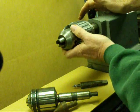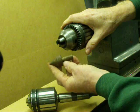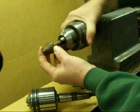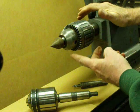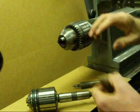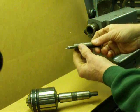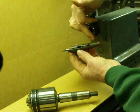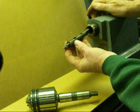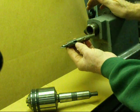One other thing you can do — and this may not be best practice either — is hold a 60-degree center with a straight shank in a chuck, sometimes just to get you by quickly instead of using a regular dead center. Also, something I forgot to show on the other lathe: these sleeves are available with a number three Morse taper — this happens to be a number two — but this sleeve has a center drill built right into it, so you don't need a chuck. Since center drilling is one of our more common operations, that's something handy to use.